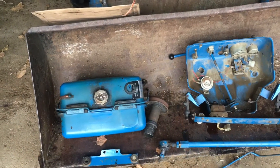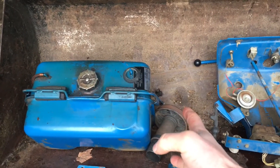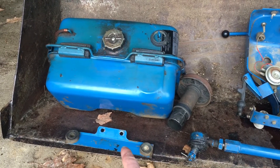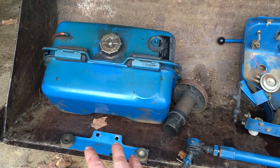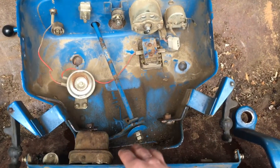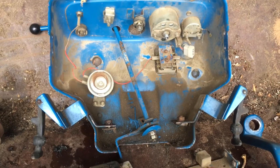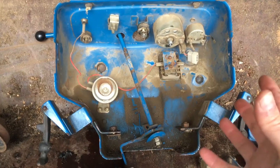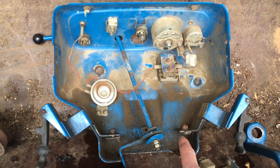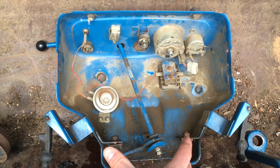To get to this point, the first thing was taking out the air intake and opening the hood — that's standard procedure. Next was removing the fuel tank, and that's a bottom support bracket for the fuel tank. Once the fuel tank was out, I went after the dash. The rubber mounts at the bottom were broken; if they weren't broken I probably could have unbolted the lower side and slid the whole dash up without tearing so much apart. I've ordered new rubber grommets and plan to reassemble the hand throttle to the brackets so the dash will just drop down onto the new steering column.